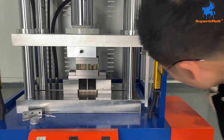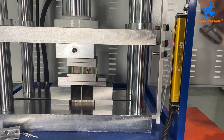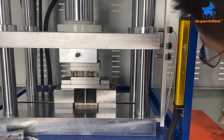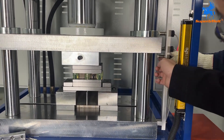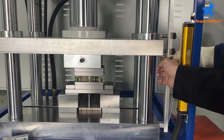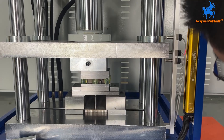And this one is the bottom limit sensor. In manual mode, it will operate at the same speed throughout. But in auto mode, it will slow down when it reaches the slow-down position. So we continue to press down — slow down — but not too much, so we must lift up the bottom limit and continue to adjust again.